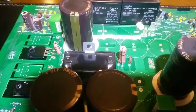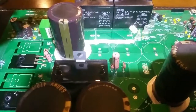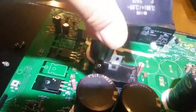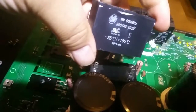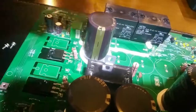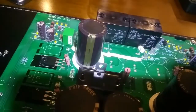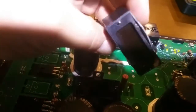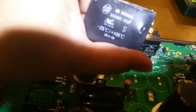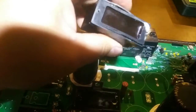After removing the board, it became pretty apparent that one of the capacitors had melted. This is it here — 350 volt AC, 10 microfarad. That was one of the ones that was okay, but the one next to it was all deformed. You could tell straight away it wasn't right. It's actually really hard to get a replacement for one of these in Australia at least. You can order them out of the UK.